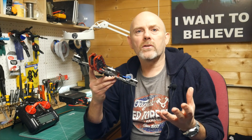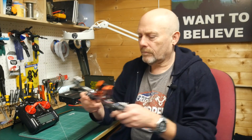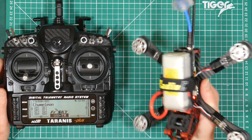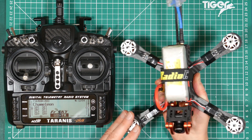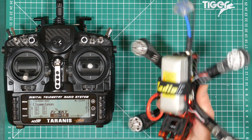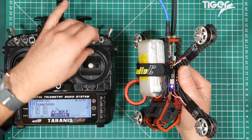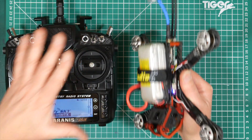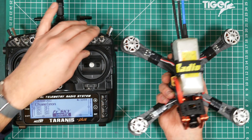But there are so many disadvantages to this setting when you're out flying, I've no idea why it's a Betaflight default. So here's my take on it. Number one: the quad won't arm. You've built your quad and you're testing it on the bench. Everything looks good. The arm switch is working but it refuses to arm the motors when you connect a battery. If you've got the quad at an angle beyond the small angle setting, that could be the reason why. And it's pretty confusing.